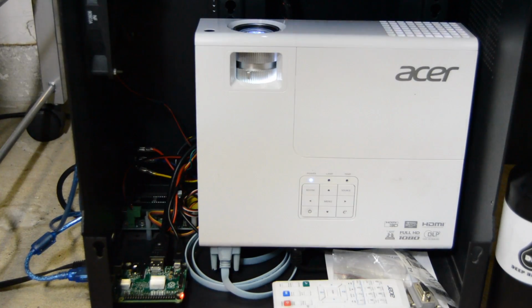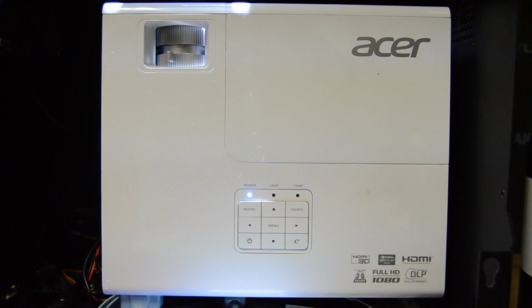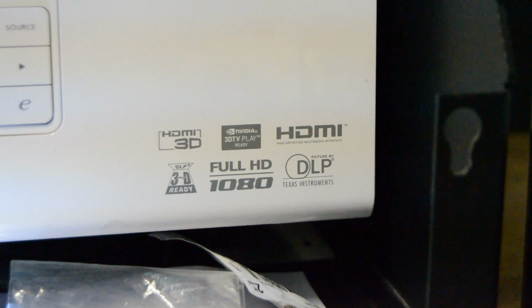Beneath the resin tank on the bottom half of the printer is a high-definition DLP projector, along with all the necessary circuit boards to run the printer. The projector projects the image up to the bottom of the vat to cure each layer of resin. This printer uses the Acer DLP projector. Not every stereolithographic printer uses a projector, but rather some use a laser to draw each individual layer.